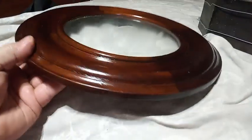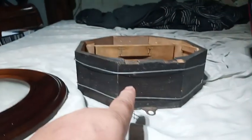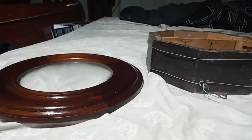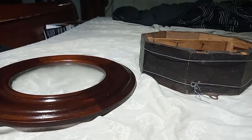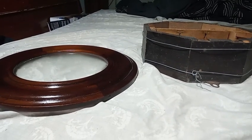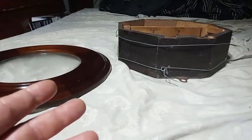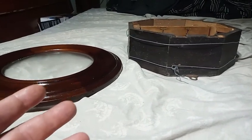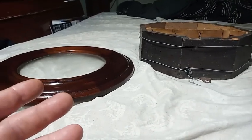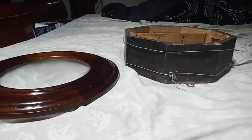Put a coat of Howard Beeswax on this. I haven't wiped it off yet, but compared to that, big difference. And I've said this before, I've used Old English oil forever. Howard Beeswax, New Life Furniture Mask, Amish milk. You know, any oil is going to bring out the wood. The wood dries up, so any oil with a cleaner, preservative, whatever in it is going to help the wood.